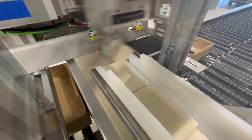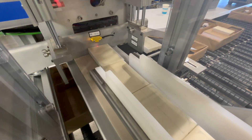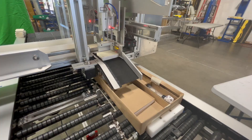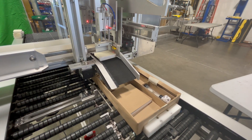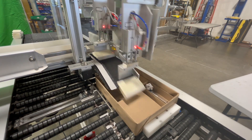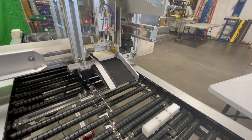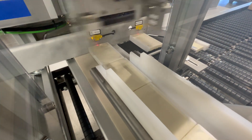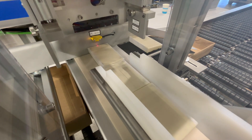Exclusive to the unloading process is the product inserter. It is attached to the end of the transfer conveyor to control how product is reintroduced into the production line. This particular one uses an X-axis actuator and dual Z-axis pneumatic actuators to push product into cases using one of three size-specific pushing hands.